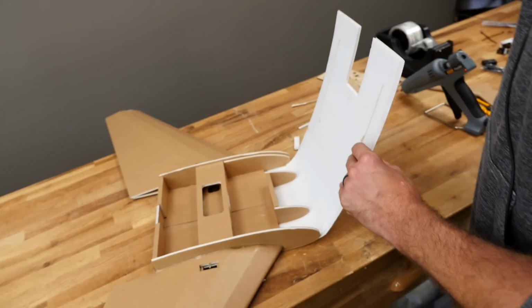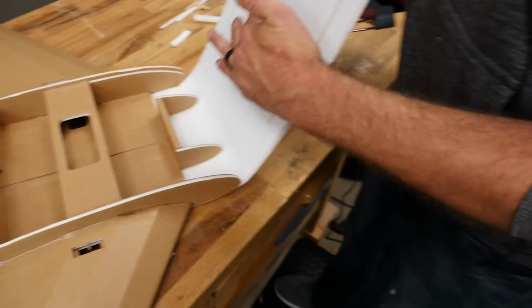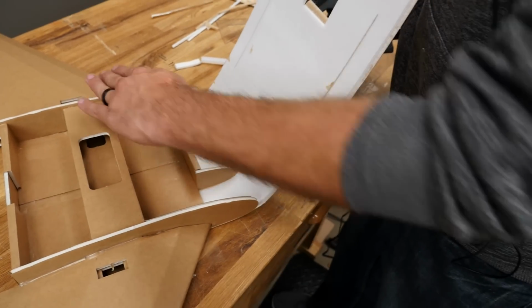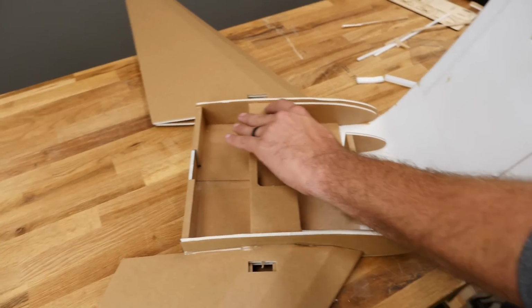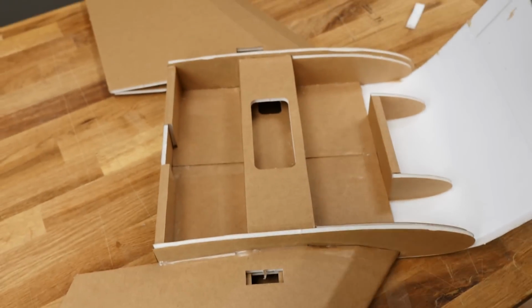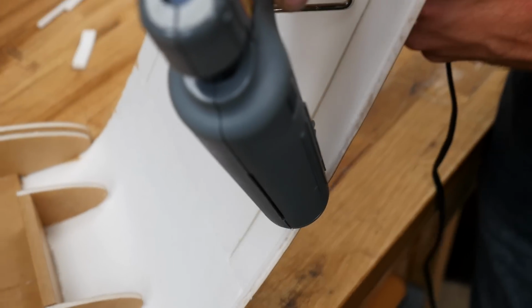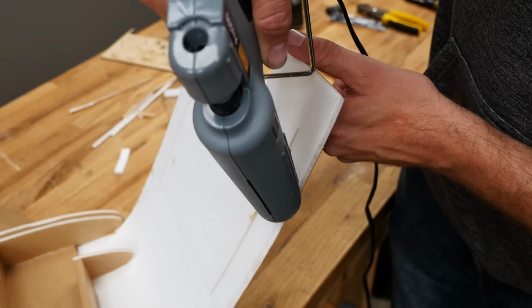We got plenty of glue. I have my extra glue stick. We're going to go ahead and put this glue down. We don't want to glue this hatch down, so we're not going to slob glue all over here. We're going to go ahead and only go out maybe a 1/2 inch on each side here. So let's go ahead and start with our paper. We're going to go a nice generous drop here, keeping that nozzle right between the paper and the foam.